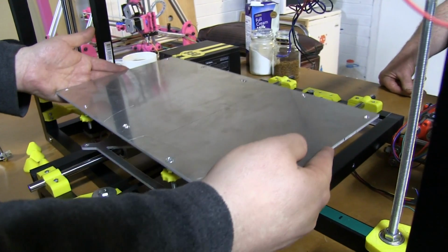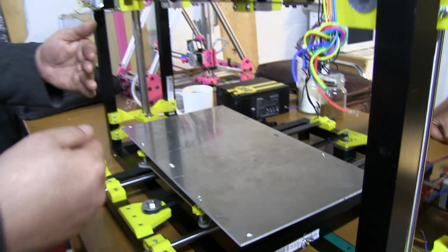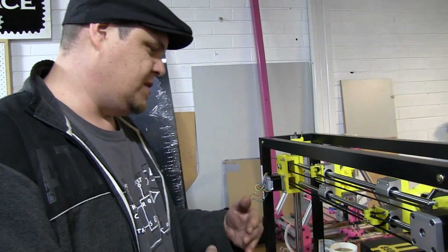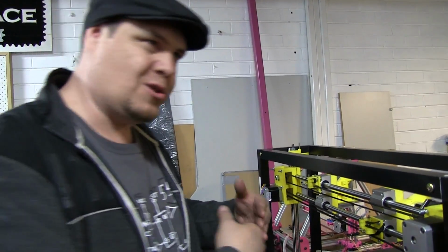I mean, it's a little bit different now too, with the new firmwares and the ability to have jerk settings, and deceleration. So the bed can travel in one direction, then before it reaches its end point, it can slowly decelerate.